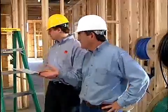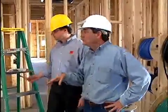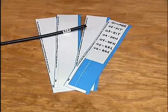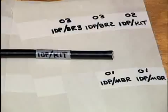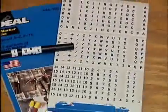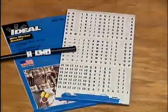Now, try pulling all the cable you need at an outlet at one time. It saves a lot of time. And to save a lot of headaches later, make sure you label each cable before you pull it. We recommend using a pre-wire trim-out labeling system like we're going to use. We're going to put a temporary label during pre-wire and replace it with a permanent label at trim-out. You'll see why this saves a lot of time later. Blank peel and stick labels, clear and white, are available from electrical and cable distributors. They're large enough to wrap 2 or 3 times around the cable with a clear part to go over your writing to protect it. You can also use pre-printed number and letter labels available from the same sources.